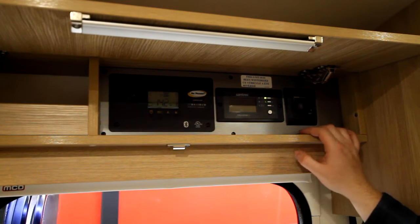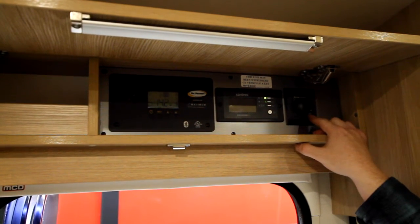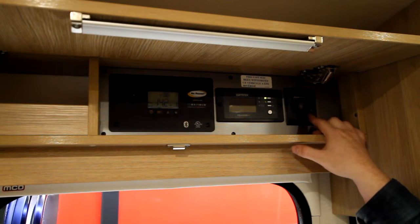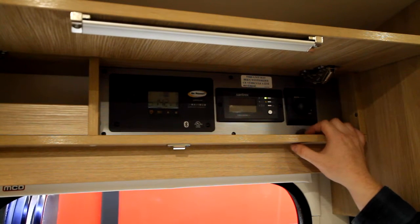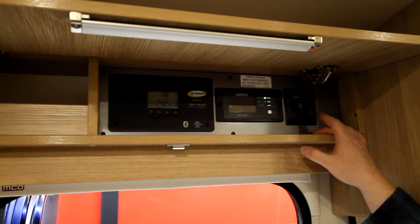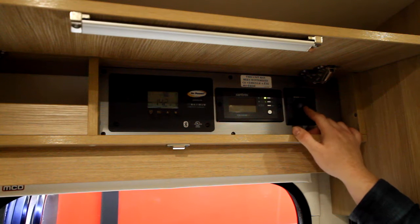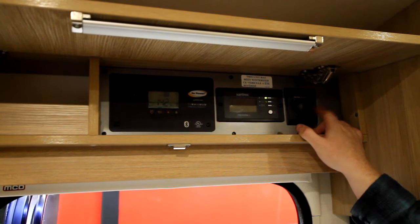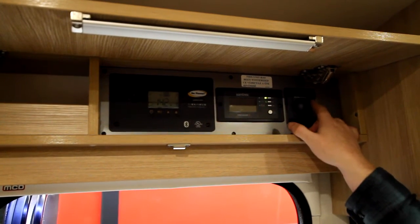Below it is clean. Clean is a two-hour sequence which is going to make our water heater inoperable until it has gone through the whole system. Once it is blinking, that means it's done. You then remove your water filter, rinse it off, put it back in, and you're going to need to run two to ten gallons of water through that water heater to reset it until the light goes off. Once that's done, turn off your water heater, turn this back to off, and then just turn on the water heater outside and you can use it as normal.